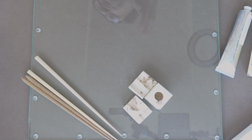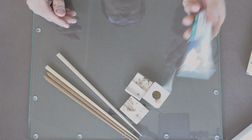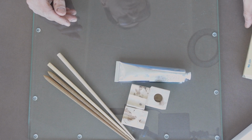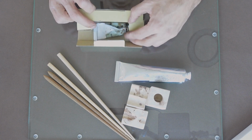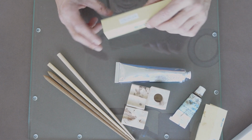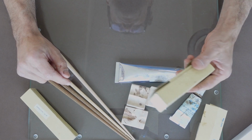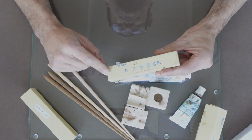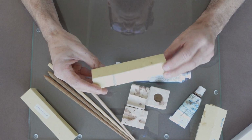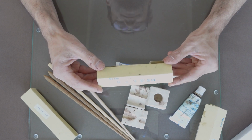What do we need for fuki-urushi? As I said, we need wood, we need urushi, and we can use Gokuyanama urushi. This one is Chinese and it's perfect for initial layers. We can use Kiyomi urushi, and this one is Japanese, and just Ki urushi, so raw basic urushi. Or even we can use sugurome urushi, so processed urushi, and in this case it's suki sugurome. It's roll milled, and it cures very fast and creates a very strong and resistant surface.